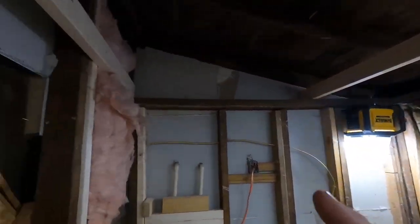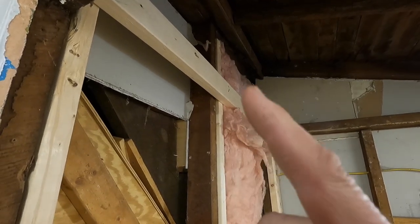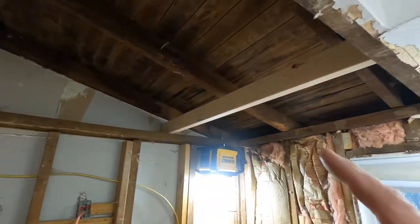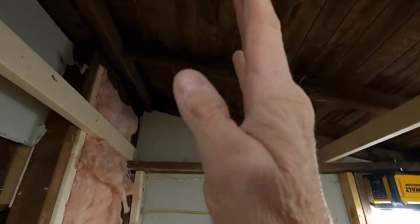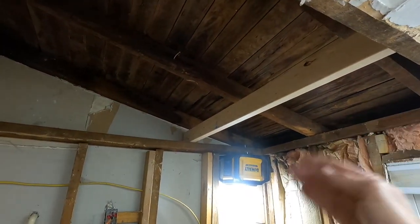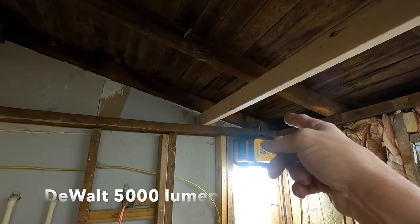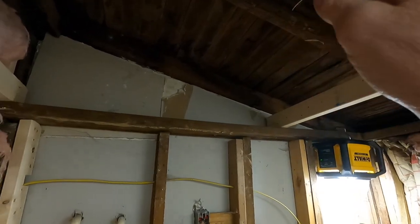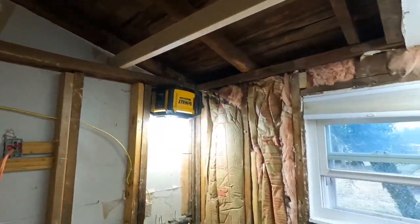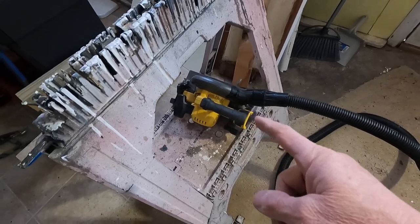Well, this is the next morning. I've put one ceiling joist - whatever you wanna call it - that the sheetrock's gonna hang on, got another one across, and I'll put probably one or two more here and one over there. I had to bring the DeWalt light with the rafter hook and hang it in - it was just dark back in this area. Pretty cold outside, so we're gonna cut our two-by-fours in here.